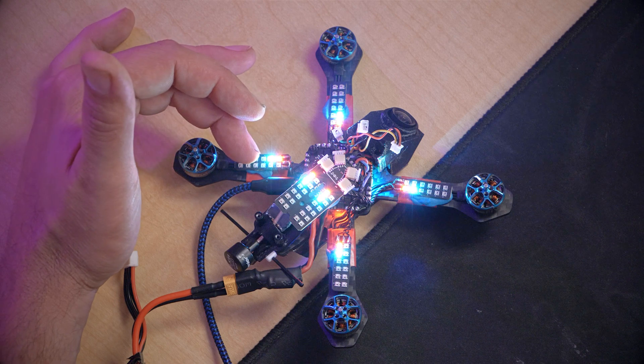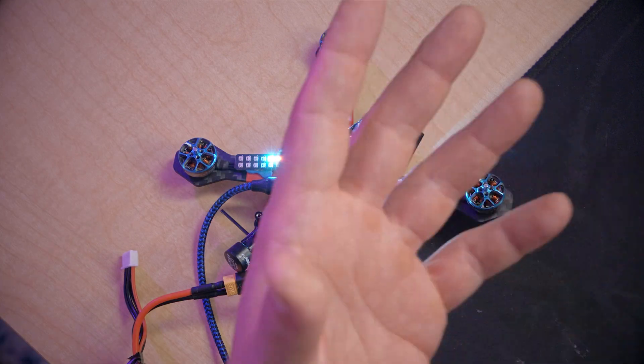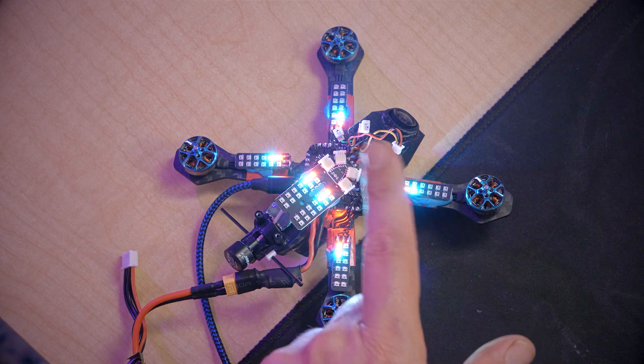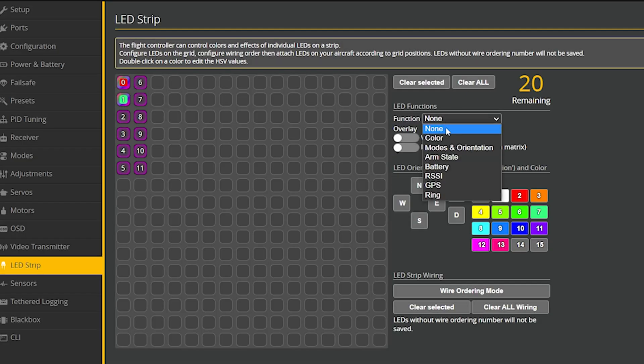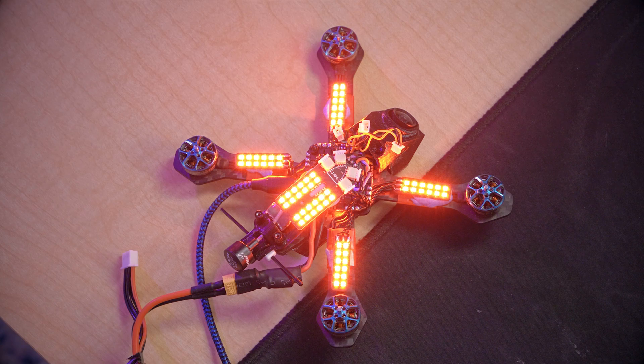It's possible these could be wired differently — all 12 in parallel so they're not individually addressable, or six individual banks that are individually addressable. There are various ways this can be wired and it's up to the designer of the LED board — you don't get to decide this after the fact. So we won't be able to make the front left arm red and the front right arm green, but it kind of doesn't matter for this tutorial because we want them all to be the same color anyway. We'll drag, highlight, pick a single color, hit save, and voila — we've done it.